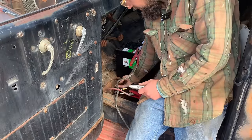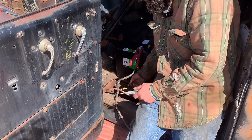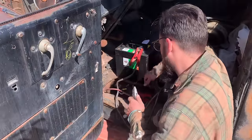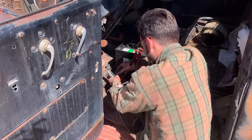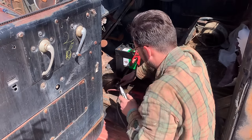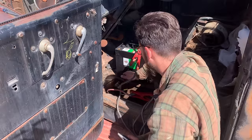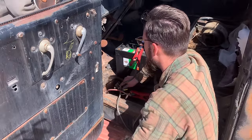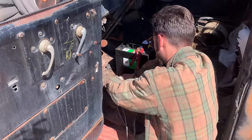There's a cable with no end and then there's a negative cable with a battery end on it. Dad said that this one is the one going to the starter and then the positive obviously goes to the frame. I'm going to razor off some of that because I can't get a good bite on it with my jumpers. As soon as we see it crank I'll pull the plugs out and check for compression. This one — it's all bolted to the frame and everything.